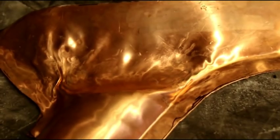But it's not a big deal. Like I say, I think I can work this stuff out by hand. It's hard to see, but like I say, this is soft copper. I might try some quarter hard stuff and see where that gets me. But I'm pretty happy with the results so far. That's going to make a nice defroster duct. And I'll fine tune everything and get the die sanded up a little better. But I just wanted to try a piece in there.